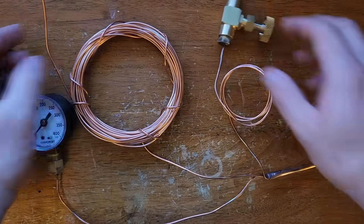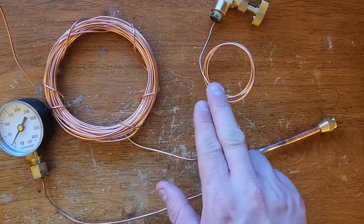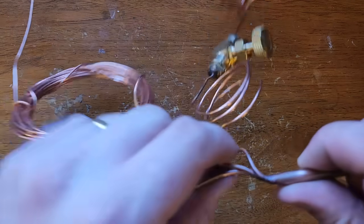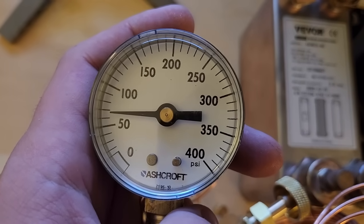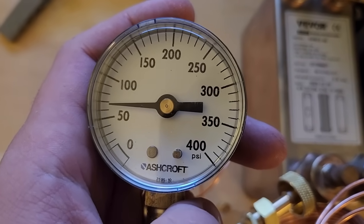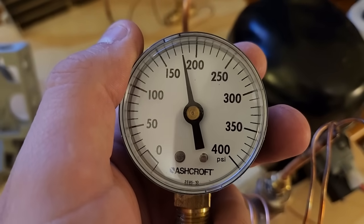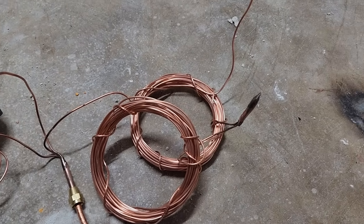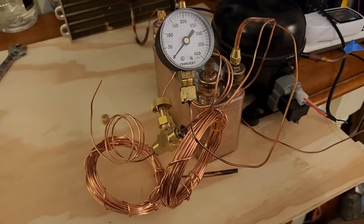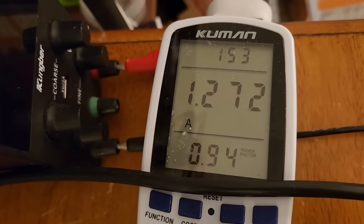Next I built the capillary tube assembly. This connects to the outlet of the intercooler with a pressure gauge, 25 feet of 1mm capillary tubing, and a needle valve to bypass the capillary for fine tuning the flow rate. In retrospect, I really should have used a smaller diameter tube so that I wouldn't need so much of it. Doing a quick test with the compressor inlet open to the air, I get about 70 psi on the high pressure side with the adjustment valve open, and close to 180 with the valve closed. I added on an additional 25 feet of capillary tubing making the total length 50 feet, and with the additional length the pressure tops out at around 220 psi when open to the air. With 1.5 to 2 atmospheres of inlet pressure, it should produce more than enough pressure to condense the ethylene when it hits the intercooler.